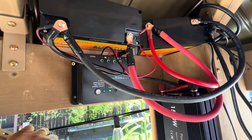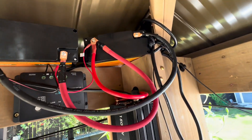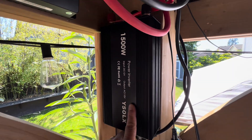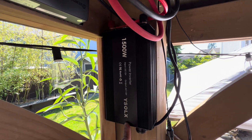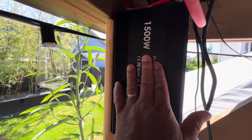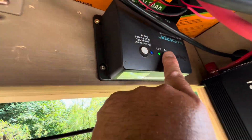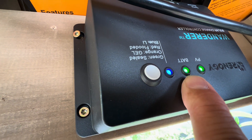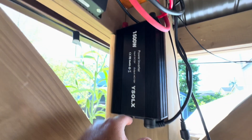Unfortunately, they both are colored black, so they don't really color-code them very well. It's attached to a 1500-watt inverter. I probably should have gotten a pure sine wave inverter — that's something I would recommend. But so far, this is working out just for my lights. Right now it's on the lithium-ion battery setting; the battery's fine, and it's charging from the solar panel because it's blinking.